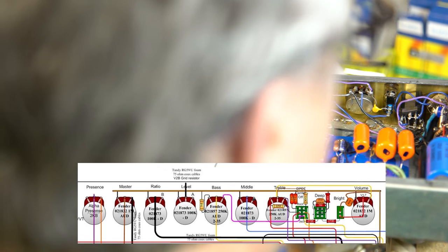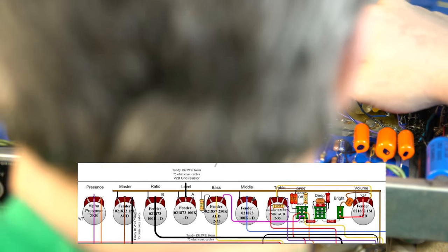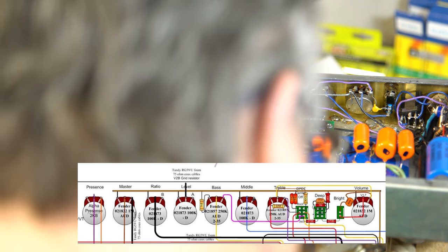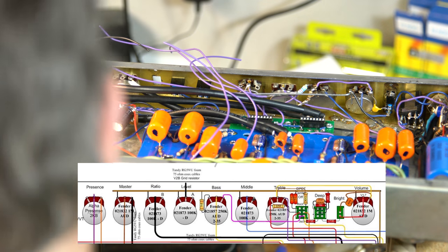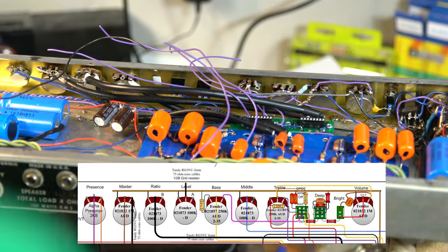Next is the mid pot. The middle pot is wired where we've connected into the center as supposed to be, but the other one just goes to ground — so I need a short ground lead connecting from the middle to ground, because the mid is just a variable resistor on this. I've got a short lead of wire to solder through it and send it to ground. When I do grounds I don't worry too much about overexposing the wire since it's just a ground wire.